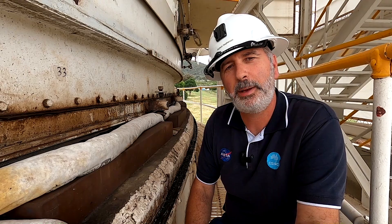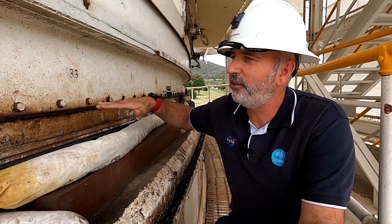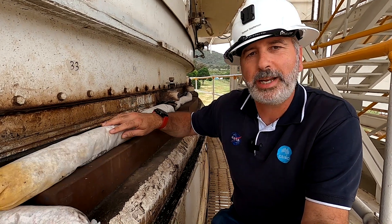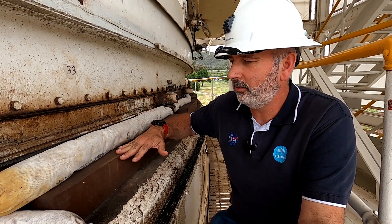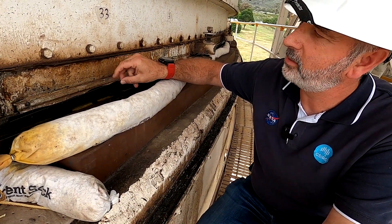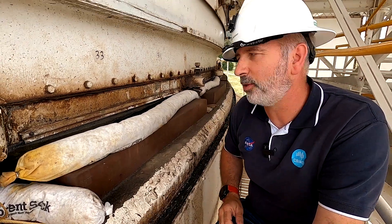After a short climb, I'm at the point now where we have the non-movable part of the antenna — the pedestal — and where it interfaces with the movable part, the 4,000 tons. This is the hydrostatic bearing. We have the epoxy resin sitting on the pedestal. On top of that, we have the sole plate, and then we have the bearing, which is encapsulated as well.